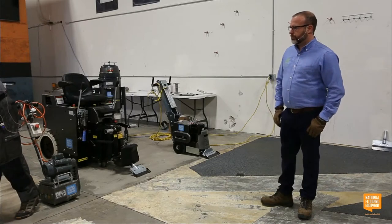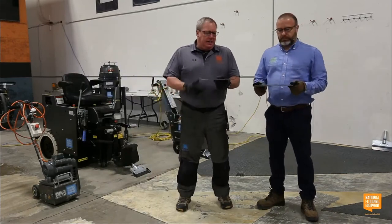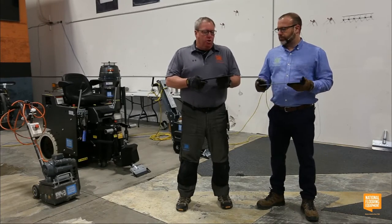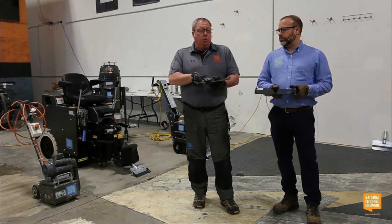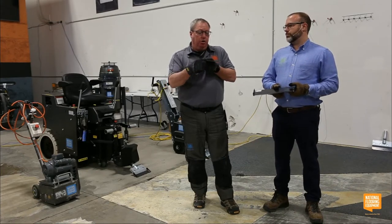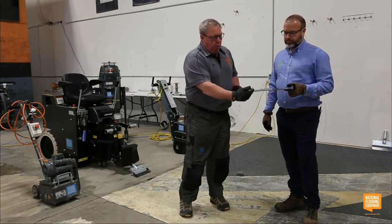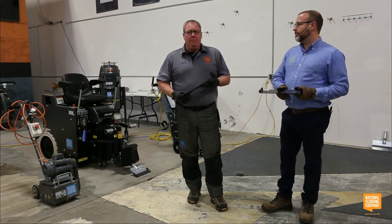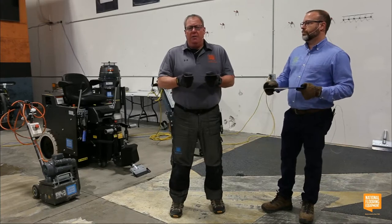A big question we get is: what's the difference between the 90° and 45° self-scoring blades? The 45s are really great for tight, low-pile carpet, and I like them because I can run a grinder all the way across and sharpen them pretty evenly on the job site. With a 90° I can sharpen the main edge, but to get into the corners you really need a round file — and finding a round file is even harder than finding your 10 millimeter socket.